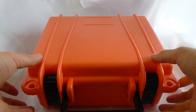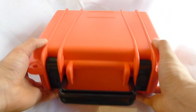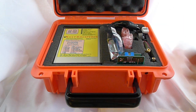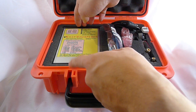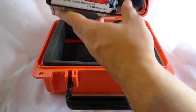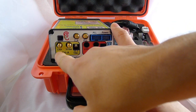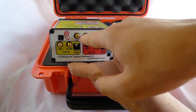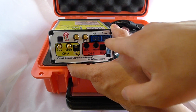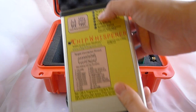I'm going to show you what's in the ChipWhisperer box. It comes in a nice watertight case, and inside we have the various tools. The core part is the ChipWhisperer itself, which has various inputs — there's the low noise amplifier, which is your analog signal input, and we have some options for clocks as well as power supplies for some of the probes and the status lights for various operations.